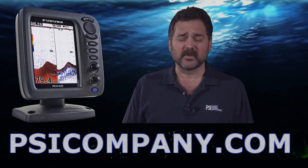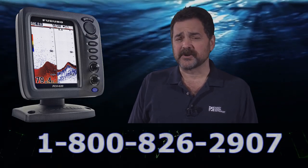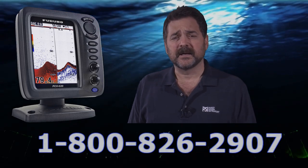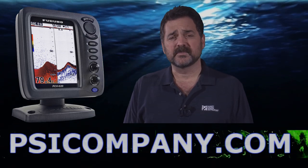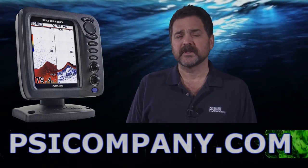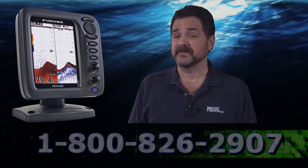It comes in 50 and 200 kHz. I'm often asked why we need 50 and 200 kHz, and the simple answer is this: the 50 kHz does a better job at giving representations from deep water soundings, and the 200 kHz gives more resolution in shallow water. Furuno incorporates both into this fish finder and gives you the flexibility to use both, even simultaneously.